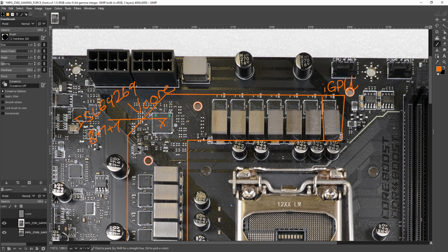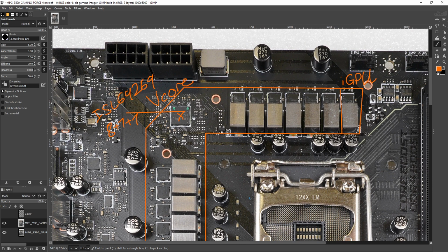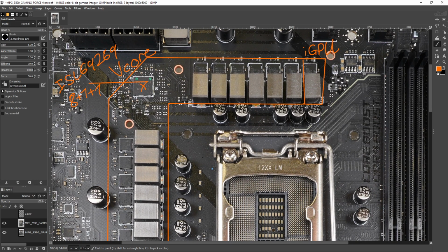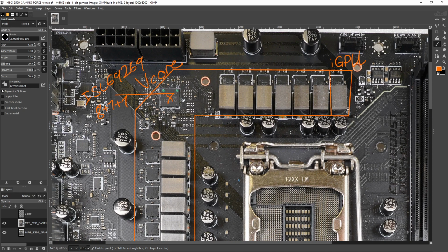And then you can have a VRM that's really weak, but in the current range where it does function, it actually delivers really great voltage regulation. Anyway, that's totally off topic. 8 phases is a totally good VRM design, and running the PWM signal into 2 power stages at the same time just doesn't really have any real downsides. I'm actually really surprised that it's only become popular recently, because it makes so much sense.